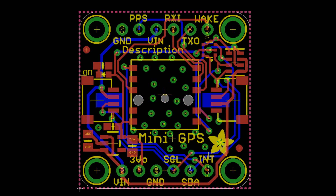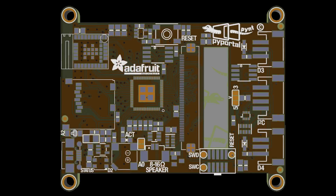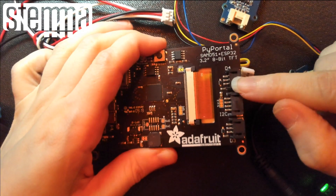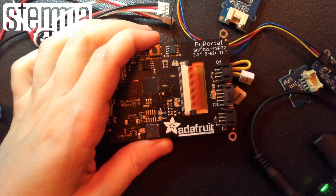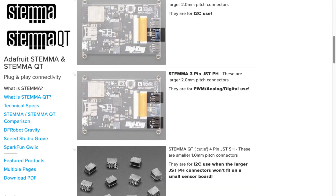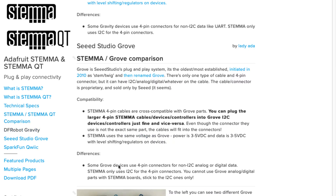Here's a GPS unit, here's an OLED — stuff that I'm doing anyway. If it's I2C, I just make it work with Qwiic. And here's a preview: we have a giant PyPortal, I think I want to call it Titano, and then we have the PyPortal Mini, which is Pynt. A lot of people have been wondering how you let people connect things, since it's not a breadboard-friendly design. You can always connect a servo or NeoPixels to the three-pin connectors, and the four-pin connector is great for I2C. With CircuitPython and our Arduino libraries, it also works with almost every platform.